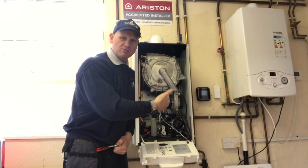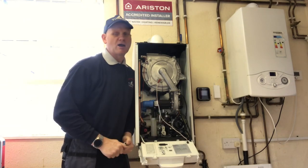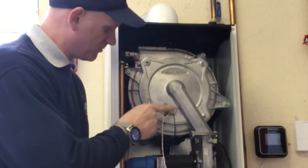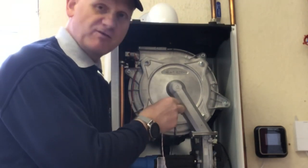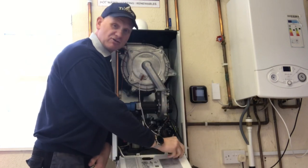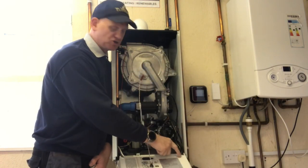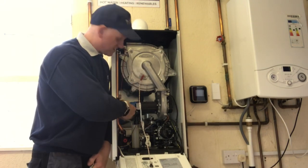We're not going to be doing any work on the water set so I'm not going to drain it, but I will show you how we drain this boiler. We're going to remove this burner - pretty straightforward, pretty easy. First thing we're going to do is remove the HT lead. Now you don't remove it from here - we do need to remove the earth clamp, but we actually remove it from the PCB. This is the lead going from the PCB ignition through to the HT. Now I'm going to remove this silencer.